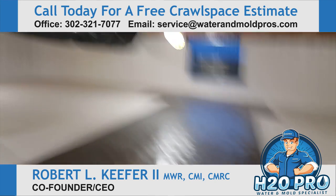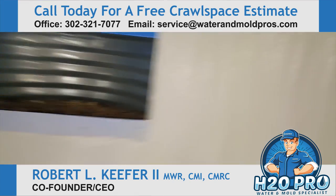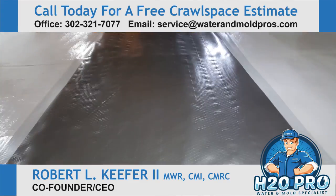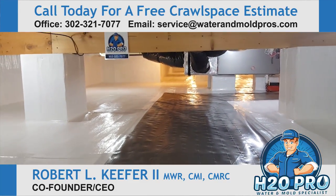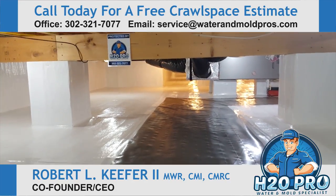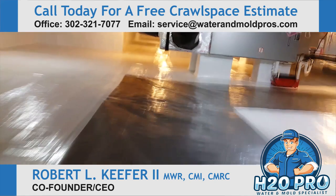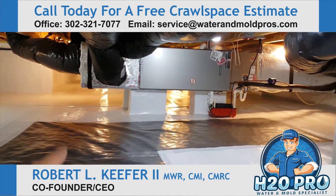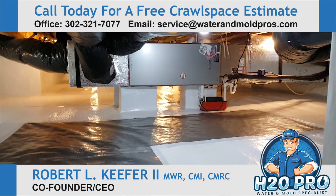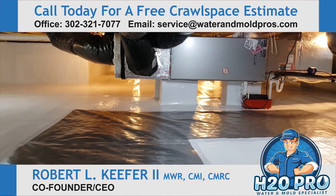We have a second entry here. If you come through this entry, there's another one of our high traffic runners — again marking our work so everybody knows who did this job, and to protect our liner. We put the high traffic mat in so that any time an HVAC technician comes to service this unit, he's not working directly over top of the vapor barrier that the customer paid so much money to have installed.